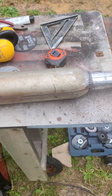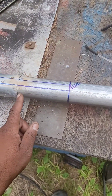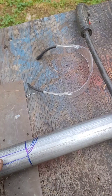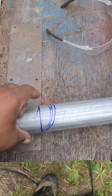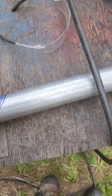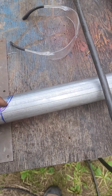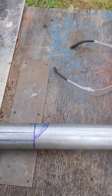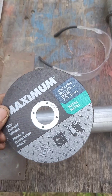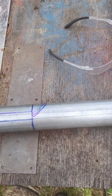After much bending and cursing — I got it measured. It's gonna be about four-and-a-half inches from here, then the bend starts. Basically you want to measure two lines, try to find your metal as close as you can, and then make a couple lines around it like a half moon to the other side — that's the side you got to bend on. Make a series of small cuts and start your bend. I recommend nice thin blades — they take off less material and you can make adjustments later.